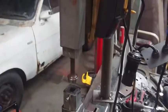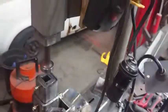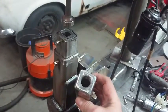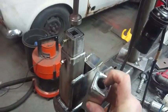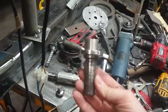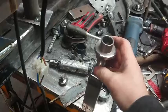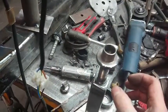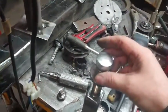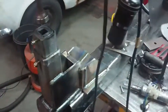That's running a very small stroke at the moment. I've also made another die — this one accepts a tow ball. There's a tow ball nut inside there, and it accepts what used to be a tow ball, now machined down. That threads inside there and accepts air planishing dies. So that swaps in, and I can use one or the other whenever I want.